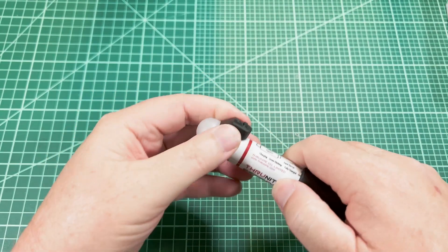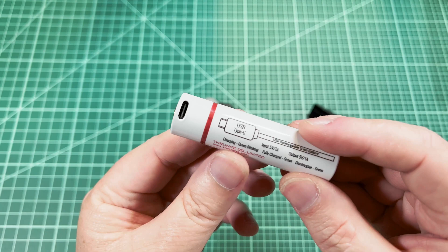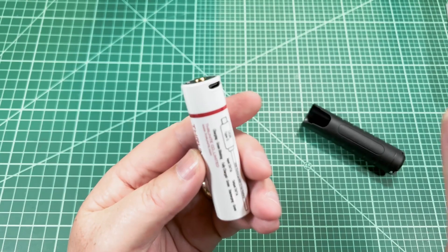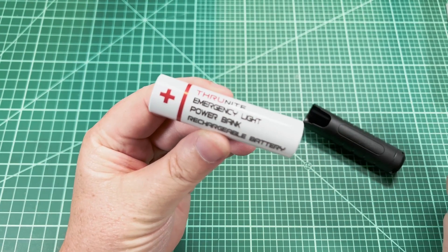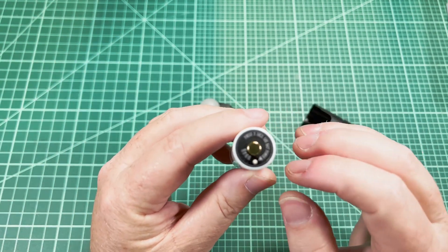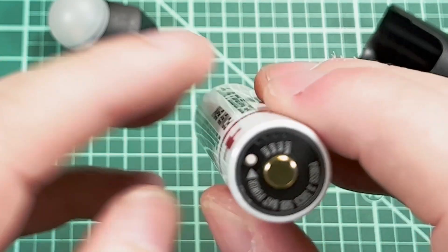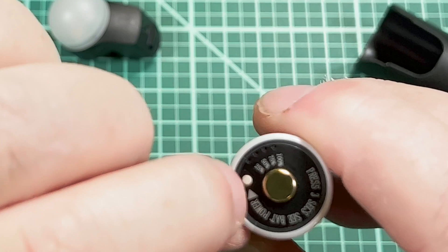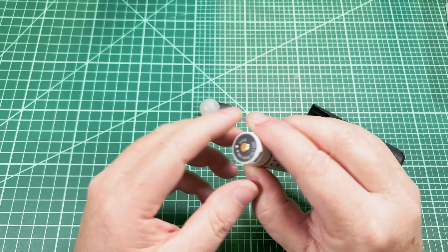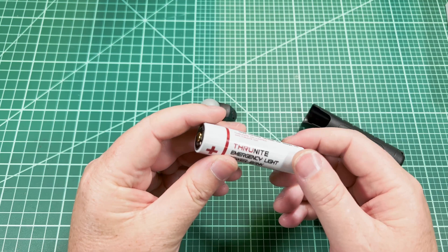Let's talk about the battery itself. This battery is an 18650 size and it is protected on top, and it has full power bank features built in. That means this little battery can be charged straight from USB-C to a power source — it can regulate its charge, so you don't need an external charger. It also means it can charge up devices. One of the things that sets it apart from other protected devices like this is that it actually has a little four-light power meter at the top and a button. If you press and hold it for three seconds and let go, it gives you out of four how charged the battery is. That is the first time I've seen all these features in an 18650. Usually you see these on the larger 21700s.